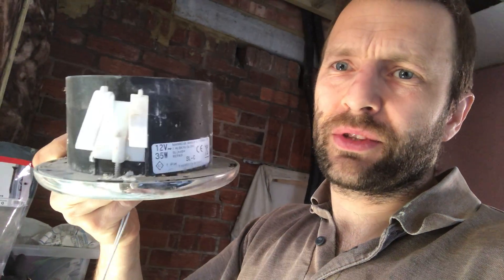The light that's going to be over the bath is actually going to be a fan. So I've got a bezel - this was in the bathroom originally. You put a downlight in the center of that and that's your fan as well. It cuts down on ceiling acne. I don't see the point in having an extra light and an extra fan - you might as well have the fan and light combined. That way I can put a lamp in there that's the same as the other downlights. And if you've got the fan above the bath, you can do two things.